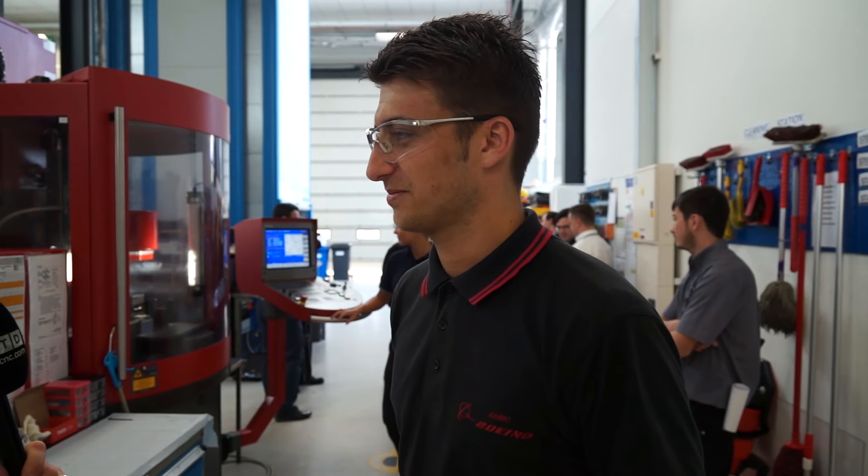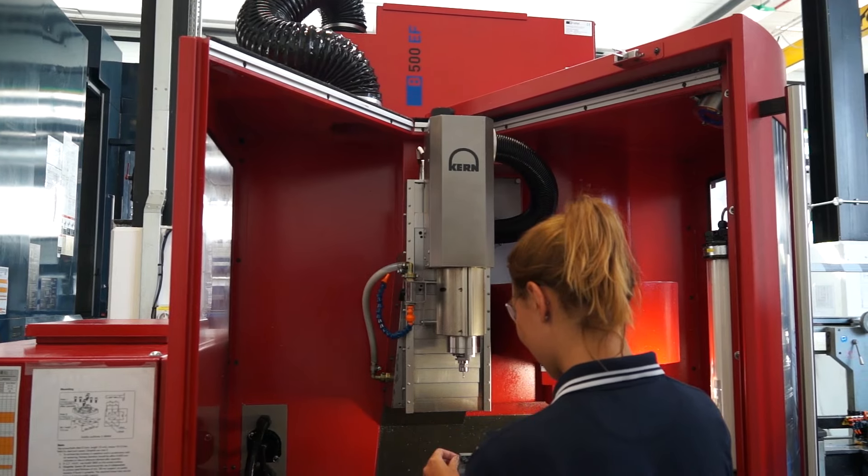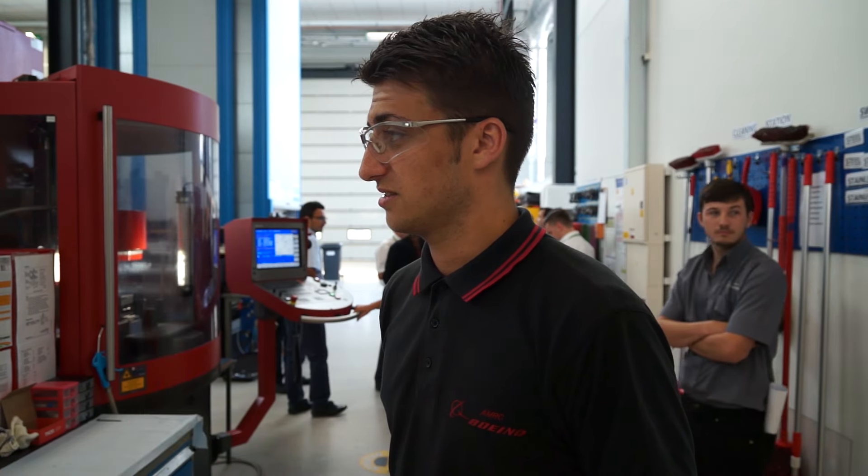And why do you need to run the warm-up cycle? It warms the spindle up and it'll change the actual tool height and radius by a few microns at a time. So we definitely need to do it when we're cutting two microns — and that is what we're trying to do here.